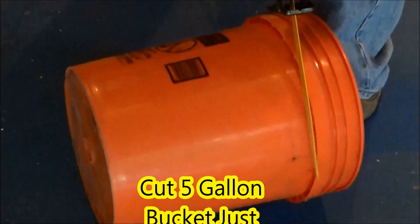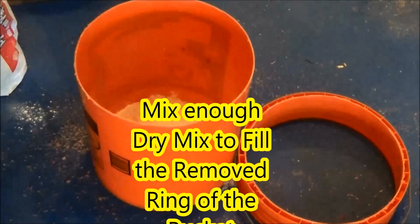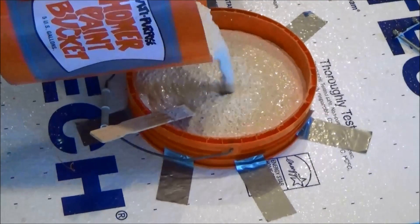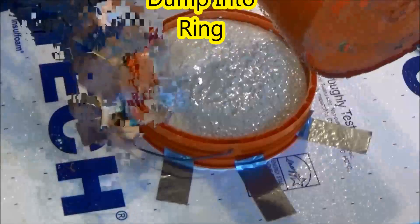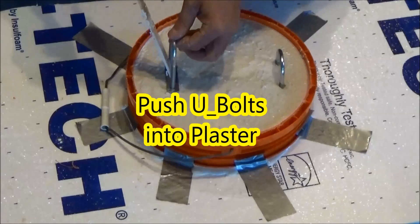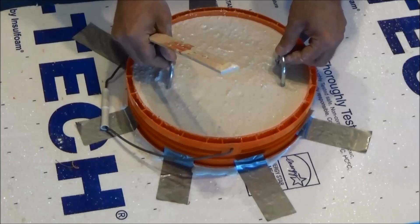Next, we're going to make the insulated lid for our foundry. We're going to cut off a bucket just below the handle — this is the bucket that I used for mixing the dry mix earlier. We're going to mix enough dry mix to fill the removed ring of the bucket, using a mixture of one part vermiculite or perlite to two parts plaster of Paris. Once you've mixed the plaster, you're going to dump it into the ring. Then I tap the sides to let the bubbles come to the surface. I'm going to place the two U-bolts into the plaster, using a stick to make sure that the cross piece of the U-bolt is down inside the plaster. This is going to be a handle to lift your lid. You want to make sure they're down all the way.